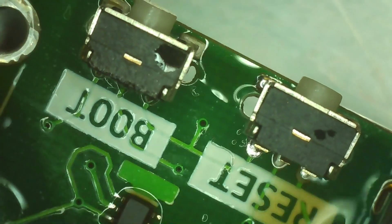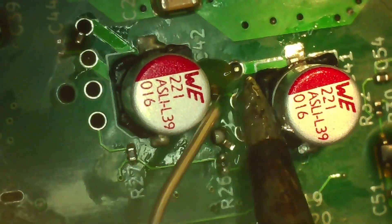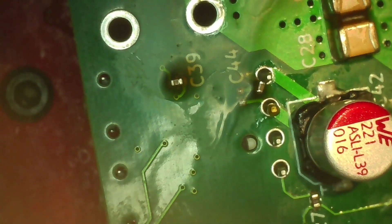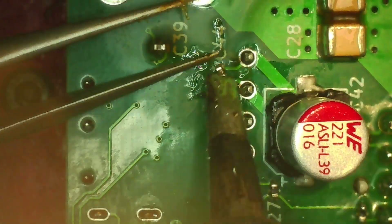When I'm soldering the USB-C, I always lift it slightly in the middle of the reflow — that helps remove any shorts and redistributes the solder evenly across the pads. Now I'm adding the fan header, the power terminals, and the rest of the connectors. These are pretty straightforward; just take your time and make sure everything is sitting flat before you finish the solder.